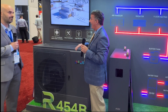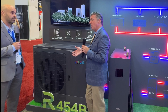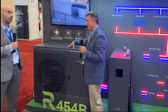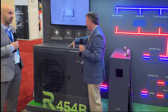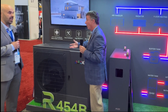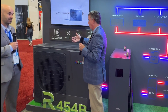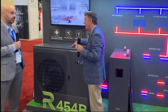Well, what if all the refrigerant was outside? We're in the business of moving heat — how do we move heat? In all sorts of ways. If we think about an air-to-water solution where my high-performance inverter — just like we were talking about with our traditional split system — is all in one unit, and we're using that technology and efficiency to transfer heat from the air into water, what are the options with that water? It's almost endless. I can run that hot or cool water to an indoor coil. I can even take out those copper line sets and use PEX between the outdoor unit and the indoor unit — it's all low pressure, and I'm just transferring heat.